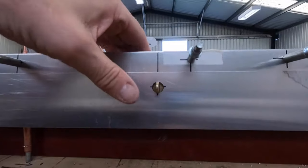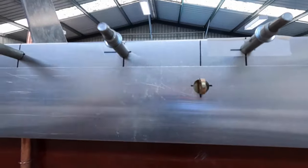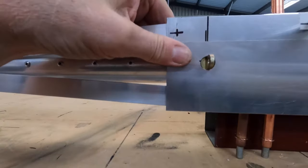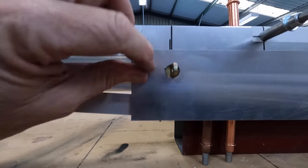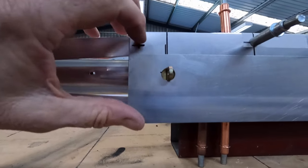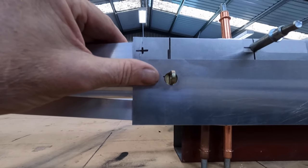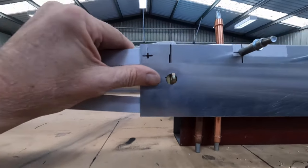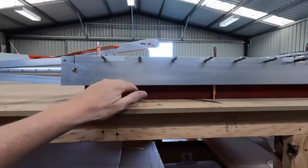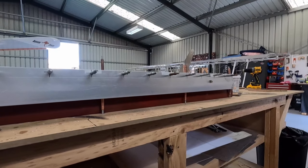Alright, you sort of get good at lining up holes doing this. So that hinge, beautiful. And the hinge down this end, nice. I might still, you know, I'm high-fiving myself, but I'll just open these up just a smidge, another two steps. So 2/16 steps, 1/8 inch. And then we'll back drill through all that on the aileron front spar.